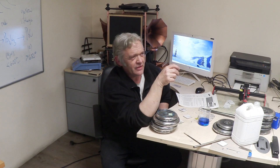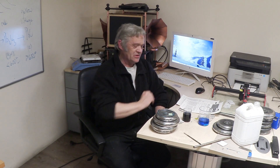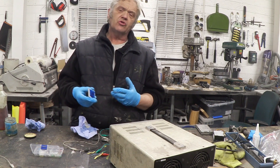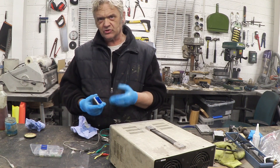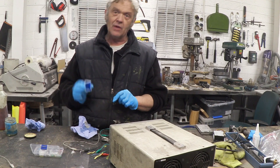So I figured I'd have a go at improving it. We made copper formate — I've done a video on it called something like 'copper nanoparticles.' If you take copper formate and add triethanolamine, it goes a really rich deep blue color — that is an organometallic ink. When you paint that on top of something, let it dry, then put it under the laser, it comes out amazing. What the ethanolamine does is not only complex the copper, but when the salt dries it inhibits crystal formation, so you get a solid sheet rather than little crystal boundaries.